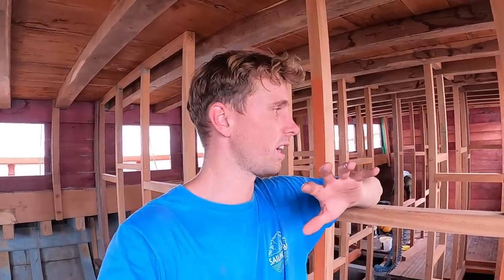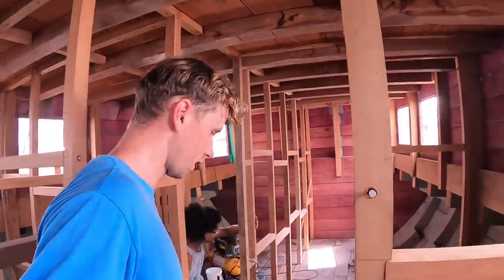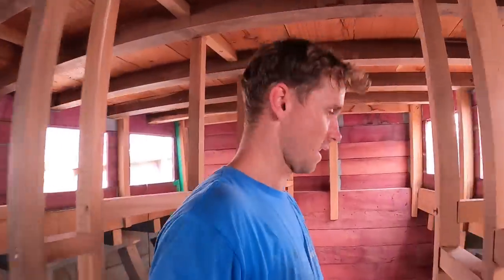It's solid enough to flatten and make look nice and paint on top, but it still moves. And it expands with the wood if it dries out, gets wet, hot or cold. So that's what we're gonna do. We've already finished brushing all these walls down, compressed all the dirt out, put ethanol in all the seams, and now he's already covered some of it with masking tape and started to fill up some of the seam here.